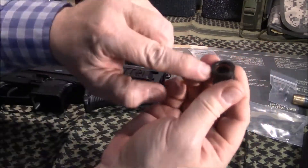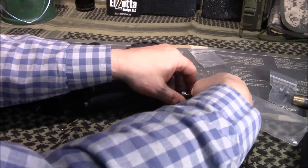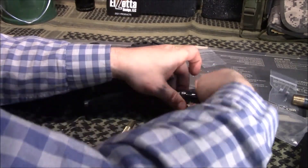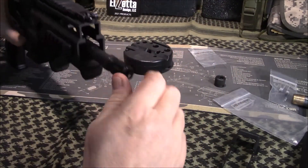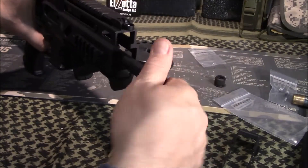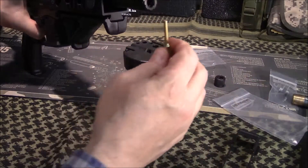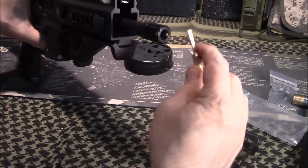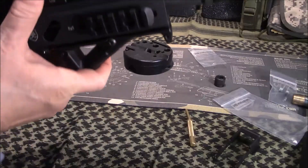What you're going to have to do is kind of push it — because of the O-ring in here, you've got to push and turn as you're pushing to get it on the threads. Always be careful about cross-threading, obviously. Once you get it going, it should be fine. I think I may have cross-threaded, so I'll pull it back off just to make sure. Anytime you're doing something by hand, it's hard to really damage threads, but you want to make sure. Just like that. If you want to take something like this punch and run through the hole and give it a little more snug — that would be the best way to tighten it. And there you go — nice looking muzzle comp. Very clean, very professional looking. Looks awesome.